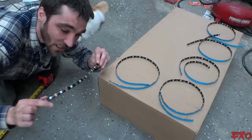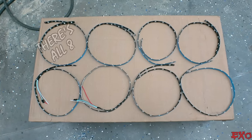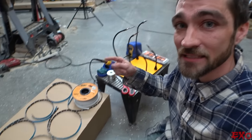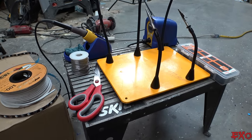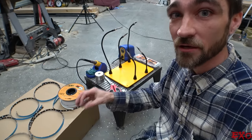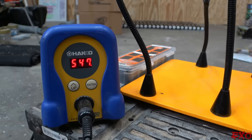Hey, that's not too bad — you only got about 11 inches of waste left over. All right, we got all eight strips cut to size — that's four per side — and we got our station all set up to do some soldering on our pigtails. Now, it's really crucial with these LED strips — there's plastic coating there — to have it at about 500 to 600 degrees so you don't do any critical damage.